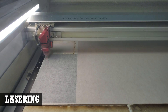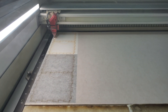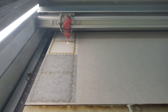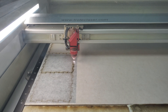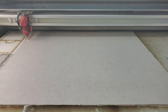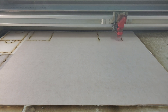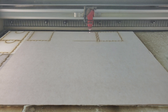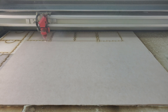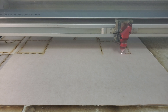I've found that cutting through both the vinyl and wood creates quite a bit of smoke, so I opted to do a light first pass to cut through the vinyl and then a normal second pass to cut through the wood. You can see that the front panels of the vinyl drawers were positioned to land on the vinyl sections of the material, while the other parts are on the regular MDF to their right. We can very accurately do this by setting our templates in CorelDRAW to be the exact size of the laser bed. This way, how we lay it out on the screen will be exactly how it cuts in the laser.